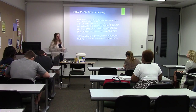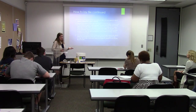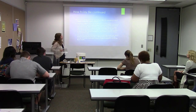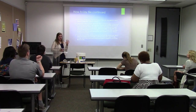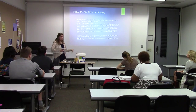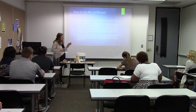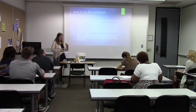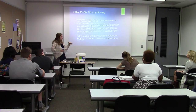Once you've measured and cut your tile, you're ready to lay it, and here's where the mortar comes in. Mortar comes in all different shapes, sizes, bags, buckets — anything. It doesn't really matter what kind you'd like, it's your opinion. According to Home Depot's site, mortar is a blend of concrete, sand, and a water retention compound that makes it easier to mix together. If you've ever mixed concrete, it's kind of like that concept where you add water and use the mixer. That's exactly how you mix up mortar, except it's mortar and you're laying it on the floor. For those who haven't mixed concrete, it's kind of like adding water to a cake mix or a pancake mix — you just add water and mix it together to get a mayonnaise-like thickness. You want to make sure it's smooth so you don't have any bumps, because if you have bumps when you lay your tile, it's going to dry funky and raise your tile.